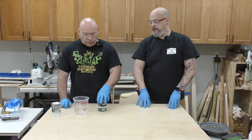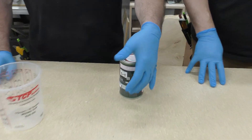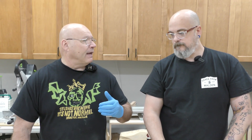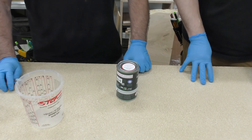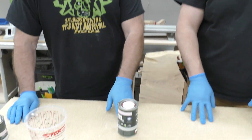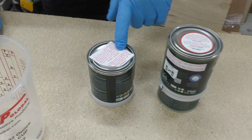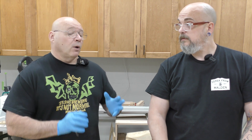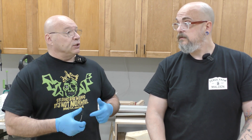It's time for a little math. When you get Rubio Monocoat, the top can is 275 ml and the bottom accelerator is 75 ml. The side of the can says to mix it at a 3-to-1 ratio. The way I've always done it: if Part A is 275, I divide that by three and get 91 ml for the second part. Since the accelerator is only 75 ml, I'm going to borrow another 25 ml to make that 300 ml of Part A, so I can pour the whole can of accelerator in.